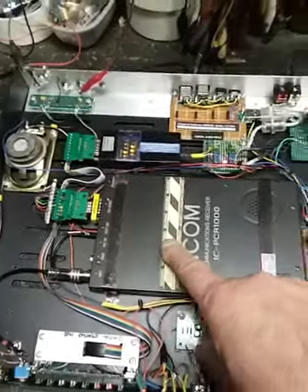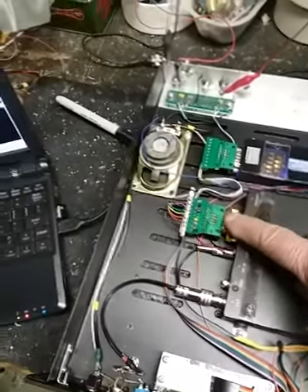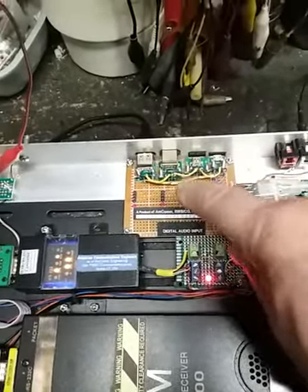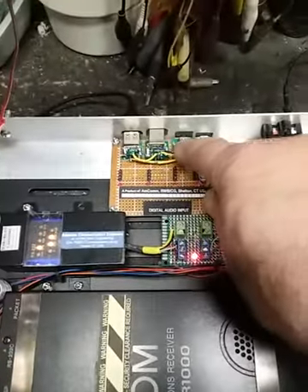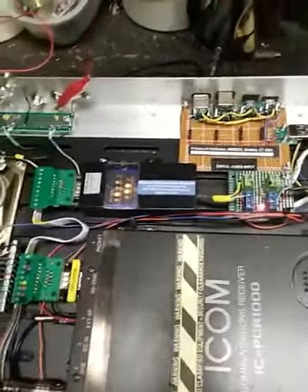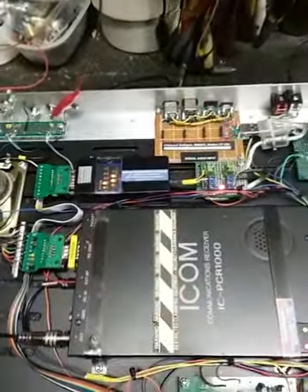Because this thing is a serial port-driven A-to-D and D-to-A device, I had to put together a little breakout board so that we could drive a USB-to-serial converter. We break out again and go back so that we have a USB input — a Type-C USB, a mini, and a micro USB like you'd find on your cell phone. We had to provide a lot of shielding and RFI elimination because data corruption in this whole S-shaped loop has really got to be controlled to keep the little bits and bytes behaving themselves.